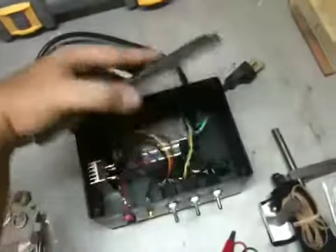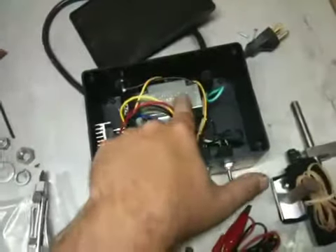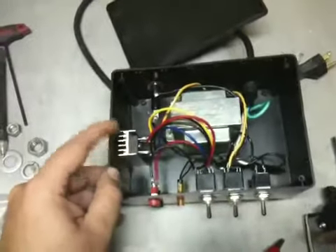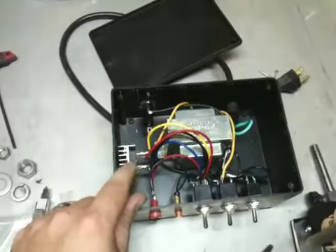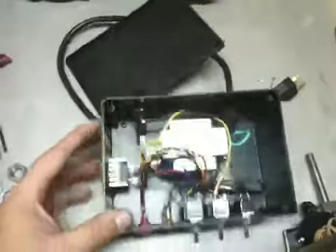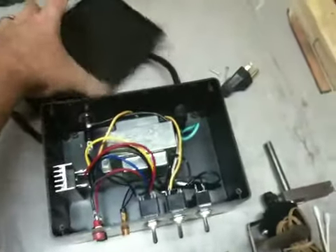Just to show you the inside - I got the screws out. Real simple to wire as you can see, just a few wires. You've got your 24-volt transformer, a little bridge rectifier to convert your AC to DC. I had some heat sinks laying around from other projects I've taken apart - televisions and what not - so I went ahead and recycled one of those. Real simple to follow the schematic if you're familiar with those at all.